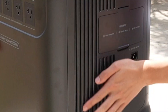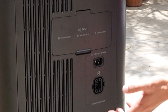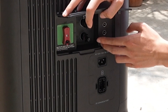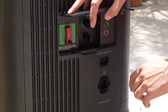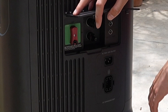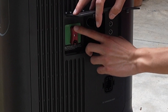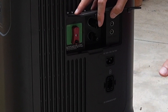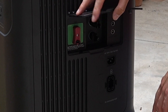On the other side, you also get lots of ventilation, and you get this little DC input. Basically, this is so you can switch between high PV and low PV. So if you have solar panels on your roof with an inverter, you can plug into these high PV MC connectors and then switch it from off to on to get the power. If you have the little panels from Jackery or Amazon, you would put it into the low PV port, which takes about 60 watts.